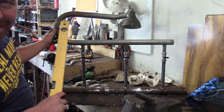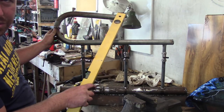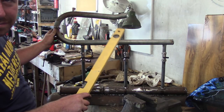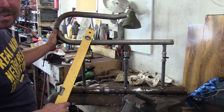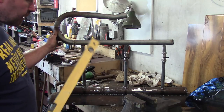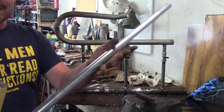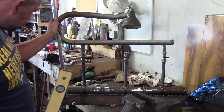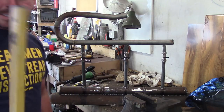I've extended the blower pipe back around underneath the forge. I'll put a little metal hood over the blower so hot stuff doesn't fall on it — if I leave it outside it's not going to be the end of the world, the blower will get a bit of shelter. I'm just going to stick some legs on it, put it the right way up, and we'll see what we've got. I've cut some legs out of galvanised conduit — I'll weld them on. You don't need to see that bit, it'll be pretty boring. See you in a minute.